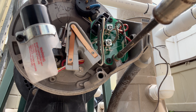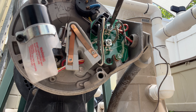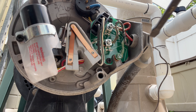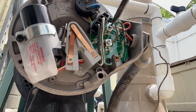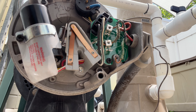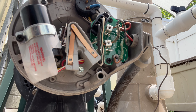Lefty-loosey just like that to loosen it. This one here I can loosen too because it's got a flat-head. I don't really have to worry about this now because I'm throwing this motor out, so I can go as loose as I want with these — I might even keep them, take them all the way out because they're good screws, why waste them? The green wire is the ground; the black and red wires are hot. This is the armature here — this thing turns.